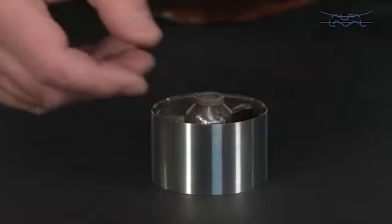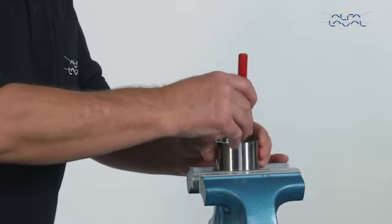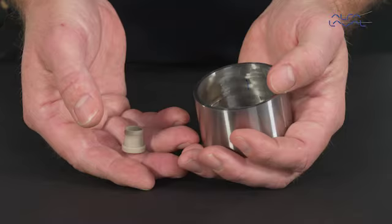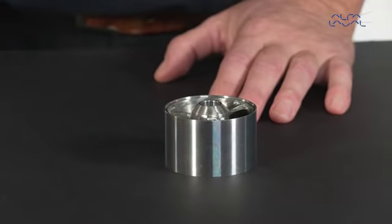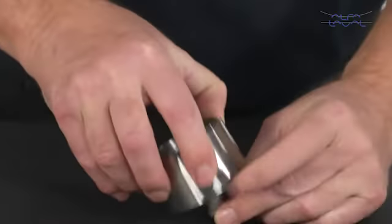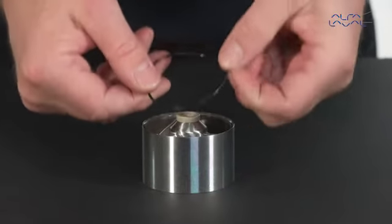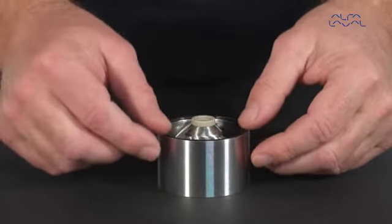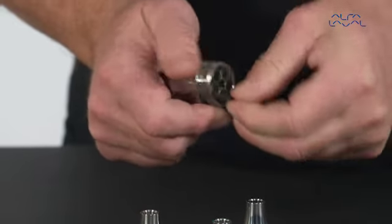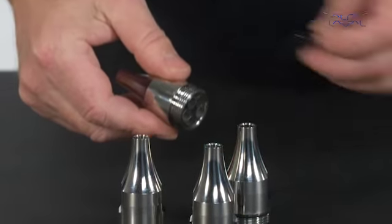Next, remove the o-ring from the guide. Remove the bearing from the guide using a drift punch. Insert the bearing for the top of the turbine shaft into the guide and press in the bearing. Insert the o-ring on top of the guide. Remove the o-rings from the nozzles, check nozzles for foreign material, then mount the o-rings into the groove on the nozzles.